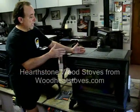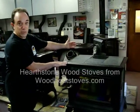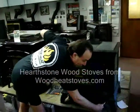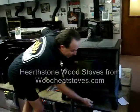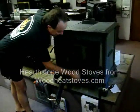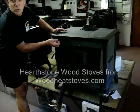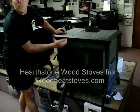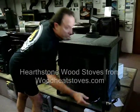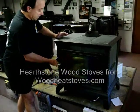Most of the stoves have many features including heat shields for reduced clearances to conserve space, and an ash drawer for ease of maintenance. Although the manufacturer can't advise it because of concerns about careless use, some customers crack the ash drawer open and let air come up through the grates, because rekindling those last little coals in the morning can be the most tedious part of wood handling. With caution, some people do that and find it's a great aid to reducing kindling and fire relighting.